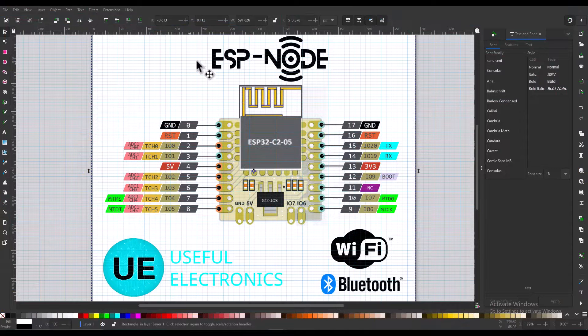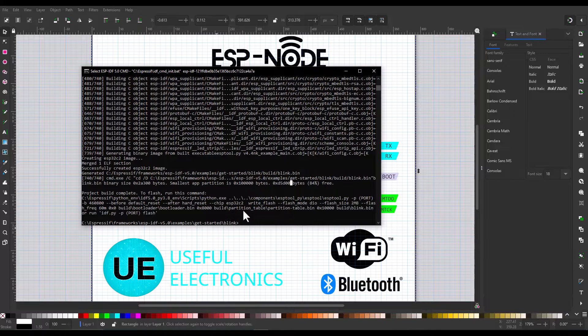Here I have prepared the pinout diagram for the development board that I designed — ESPNode. I can see all the GPIOs and the peripheral pins from this diagram. On this side you can see the important pins, which are aligned with the programmer board. Here I have the ground, reset, UART transmission, reception, 3.3V pin, and boot. So this side can be connected to the programmer without using any external jumpers. The LED blink example is compiled and built for the ESP32C2 chip, so now let's flash it to the development board.